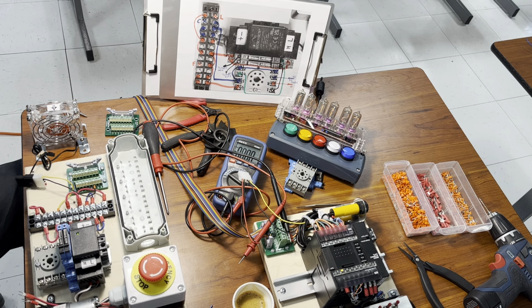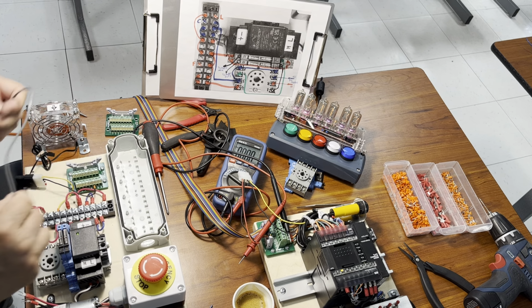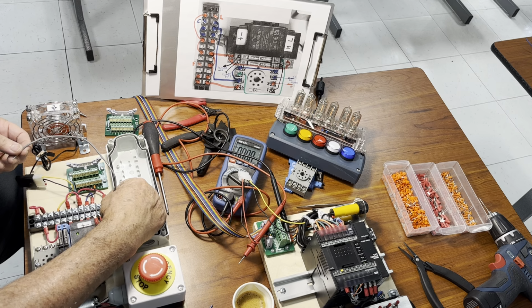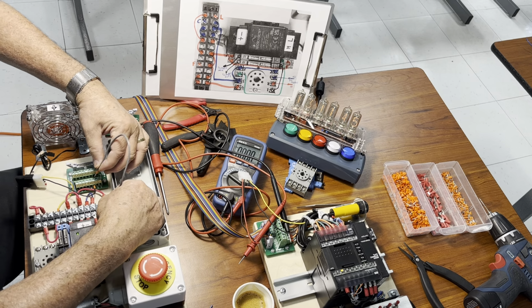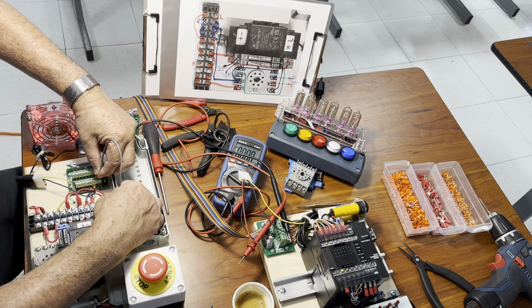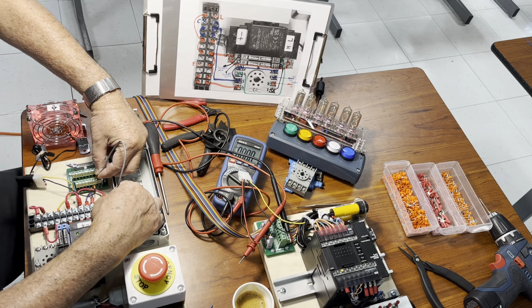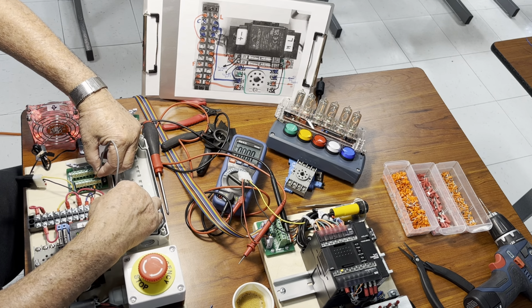However, in the moment we want the fan to receive a command, we just need to use an extra wire, okay? Like this one. And by having an extra wire, we're going to put one end of the wire anywhere I can find a blue representing a negative, and I'm going to place the other end of the wire on the black on the interface. As you can see, the fan starts turning, okay? So anytime I'm touching this pin 11, is like the fan is receiving a command from the PLC to turn, see? So it's turning on anytime I'm touching this, okay? So that's how we can check it.